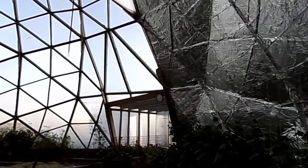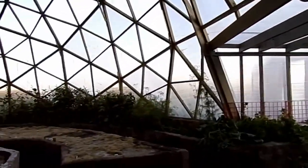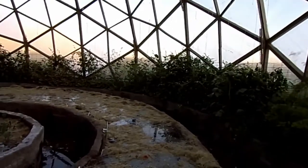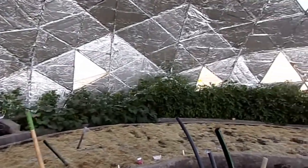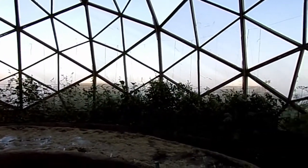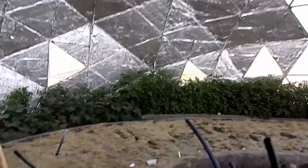I have a primary and secondary water recycling system. I depended on flood irrigation, which uses minimal pressure and high flow to flood an area. There are benefits to that because there's very little power consumption — pressurizing water to spray requires a lot of power. By avoiding that, you can save a lot on energy costs, which means you can use an off-grid solar panel.